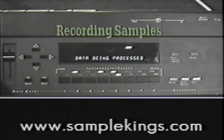The length of your sample being recorded is determined by the time that you press yes once more. So if you never press yes, you will use up all of the sampling time in the EPS. And this could be anywhere from 1 second to 3 minutes, depending on the rate that you use. After you have pressed the yes button to stop the sampling, the display will flash "play root key." The root key is the note on the keyboard that the sample will play back at unity. Unity is the same pitch as the original input signal. So whichever key you play in response to the play root key prompt, that key will play back exactly what you sampled.